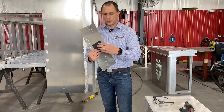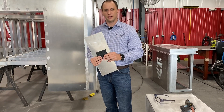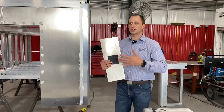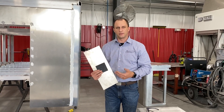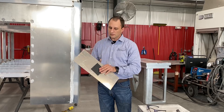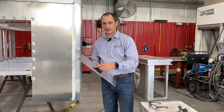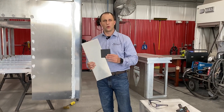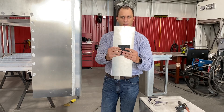When we do this, we do a welded-in wall. One may ask why we do a welded-in wall — it just makes it extremely strong when we do that, and we are sealing every single joint with a weld. No matter how good you are with a welder, we do have to start and stop about every eight to ten inches so we don't warp anything. So we use the PPC coating on top of the aluminum.